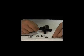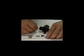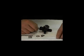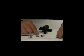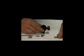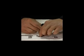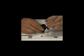By removing one thick or red shim, you will result in a medium or 650 psi output pressure. By removing the two red shims, you will get a low 500 psi output pressure. The thin shims help to fine-tune the reg and usually do not have to be removed unless a more exact pressure is required. To reassemble the reg, put in the desired amount of shims. In this case, one thick shim for medium 650 output pressure. Then, place in any other of the thin shims in any order.